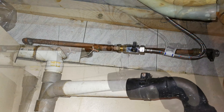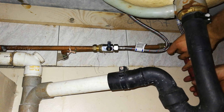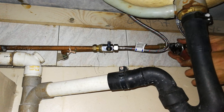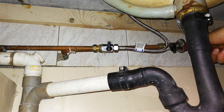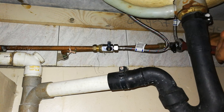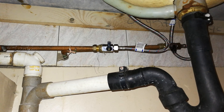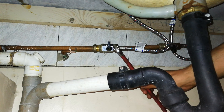This is coming to the end of the video - we did the exact same thing on the pipe behind. Pipes often run in tandem because of the hot and cold, so for the other one you follow the exact same steps already shown. Just remember: the flexible pipe does not need to be very tight because it has a rubber washer. When using hemp you also don't have to make it very tight, because the hemp expands and forms a water block - water cannot come through. The one you do make quite tight is the connex, where we connect to the copper pipe itself.